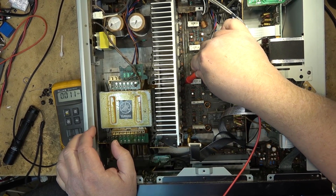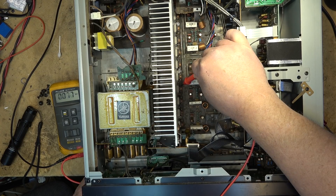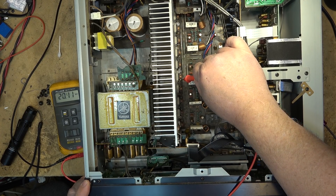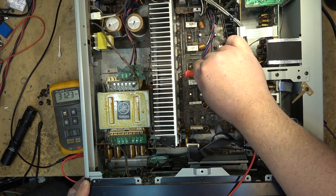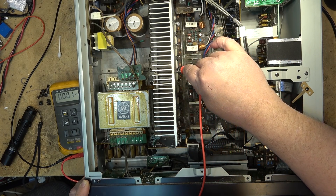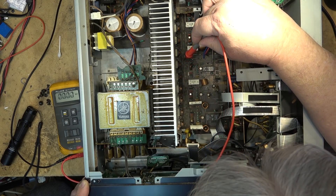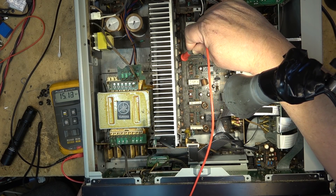What I'm doing is checking all the outputs to see whether there's any DC voltage present. So when I turn it on, that goes down to zero. There's always DC voltage present when the unit is powering up or shutting down as it goes out of balance. But when I power it up — okay, that one's got voltage on it. That output's got a DC offset of about 20 volts. That transistor is in conduction. It works in conjunction with this one here, which is at zero. That's probably why these might be shorted or leaky, or there's an open connection somewhere. This set of transistors here is where the fault is.